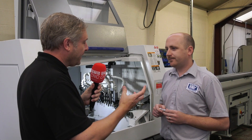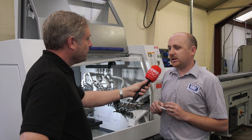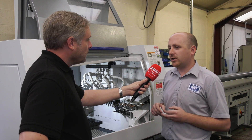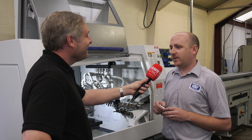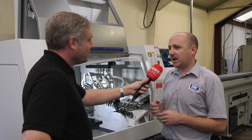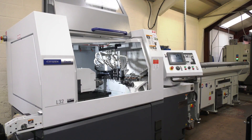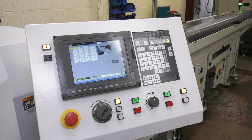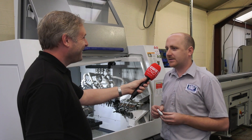Impressive. When you say clashes, does that tie in with the controls? You basically just have to watch the interference zones — you can turn them off, but you've got to be careful when the sub spindle comes over to eject. Now you've got the Mitsubishi controls — you're a big fan of them? I learnt on Mitsubishi controls many years ago. It's a great control with the pictorial aids; the tool setting and geometry are really good visual aids.